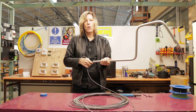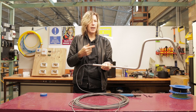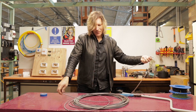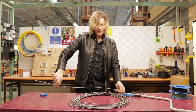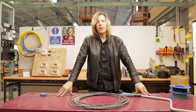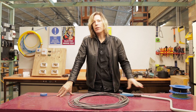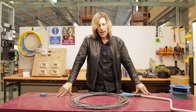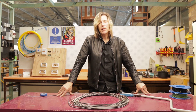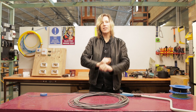If you're getting stuck and it won't go any further, just wrap it around your hand, it tightens up, give it a good shove and out it will come at the other end. That is all there is to it when it comes to running conduit snakes. They are a very, very handy tool to have and we use these all the time for various different parts of the industry. I hope you've enjoyed this video and learned something from it. Please make sure you like and subscribe and I'll see you in the next video — have a nice day.